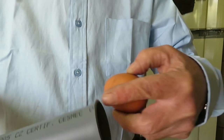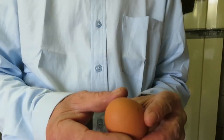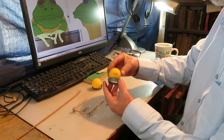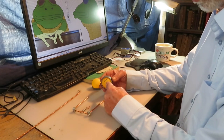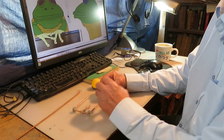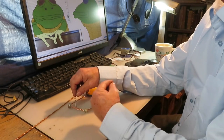That line measures the diameter of the ball, so if it's too big I just have to cut it down to the right size later. These eyes have a PVC frame which should help with the movements of the balls, as rubbing against silicone probably makes movement harder. You make a hole in the ball, place this wire inside and fill it with silicone so it's fixed firmly there. It has to hang from the top of the head so the eyes are always in a normal position and only move when you make them move.